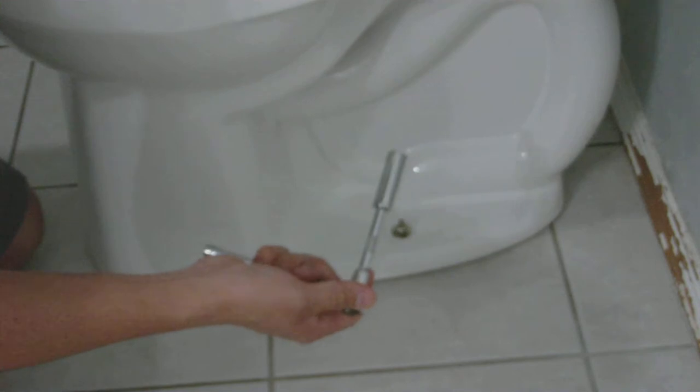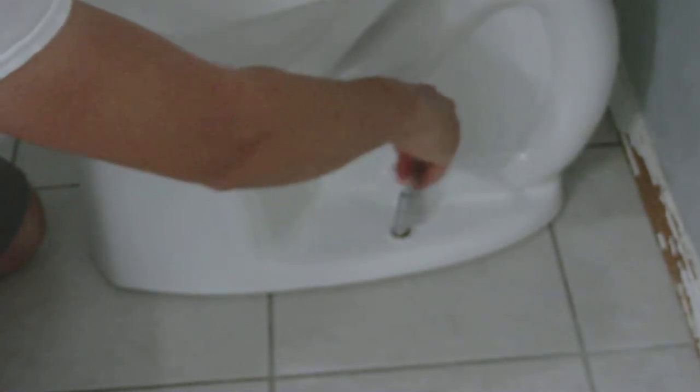We're going to drain the water out of the back and out of the toilet bowl. I'm using my siphon from the fish tank. I went ahead and took off the front filter piece so that doesn't fall in there, and then you just squeeze the little bulb to create suction — the other end going straight into the tub.